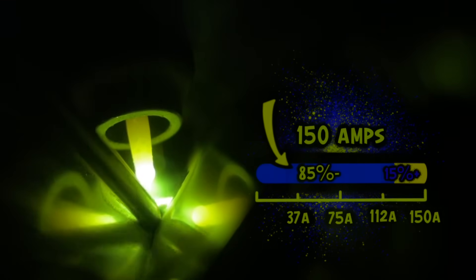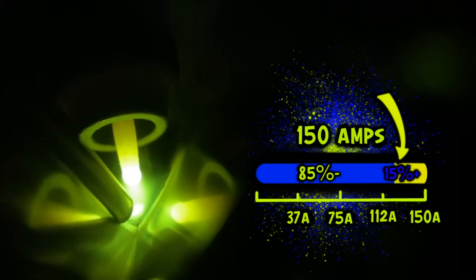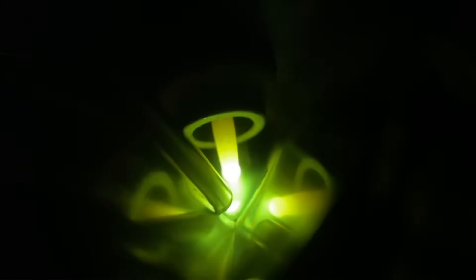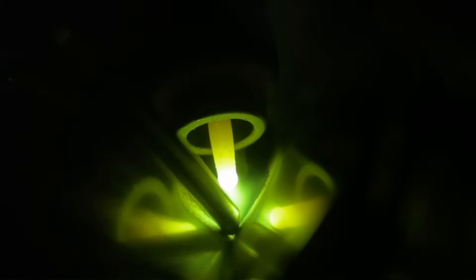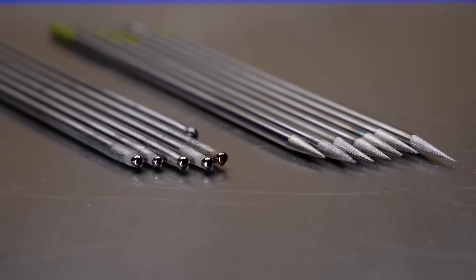When I start to weld something that requires a little more heat, I'm going to increase the negative side of the AC cycle, therefore decreasing the positive side. As we start using more amperage to do a hotter weld, we are still going to get the required cleaning action of the positive side of the cycle, but we also use less of the positive side so that we do not see the tungsten being affected by any misshaping at all. For running a pointed tungsten, you're absolutely going to want to use more of the negative side of the cycle to help keep your pointed tungsten nice and sharp.